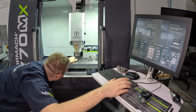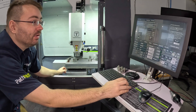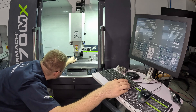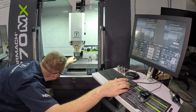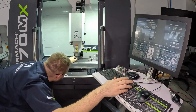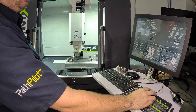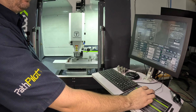I'm going to change to step mode in thousandths and start stepping up. Now I can get my 1-2-3 block in there — this is fairly good, it's pretty tight as I drag it. I'm going to come back down a little bit and change to ten-thousandths increments just to make sure I have the best accuracy I can get, then step back up again until I can just get my 1-2-3 block in. Then, following our instructions, we want to set our z-axis work coordinate here to zero — I can either highlight this and type zero then press enter, or press the zero Z button. That's what we want.